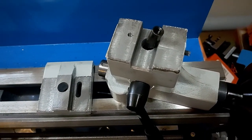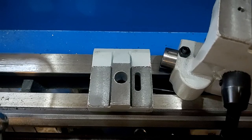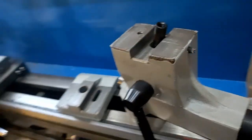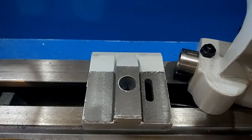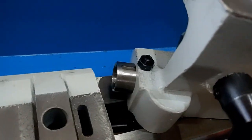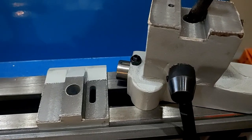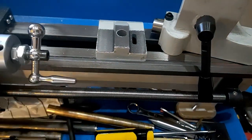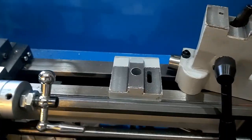A quick mid-process update while adjusting it for left to right. A couple of little problems to point out: they painted this after it had been assembled, and they over-painted — the paint is very heavy, so when you take this apart, the edges do break away. That's a minus half point deduction for that. The quill alignment pin is right there, which is better than what they do with the Vevor. I'm probably going to take a file and clean this surface up.